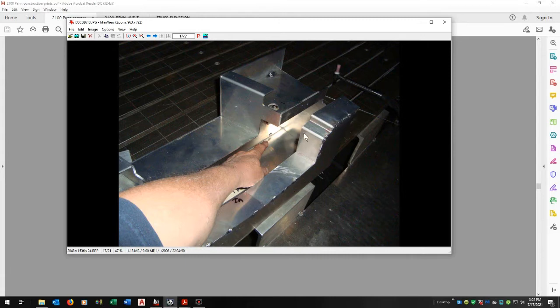I think there's enough room that you can get into the box and wipe sealant on the inside of any welded seams. There are a lot of new welders, so please make sure you back up every welded joint with sealant. We don't want a pinhole in there because it's going to be really hard to track it down later and figure out what's going on. That's the box.